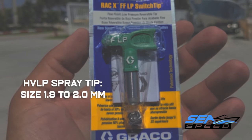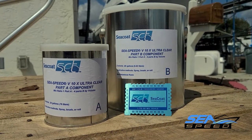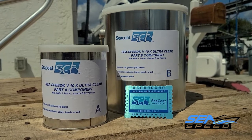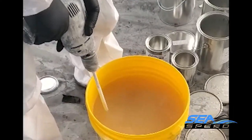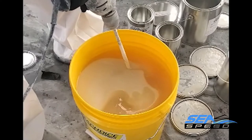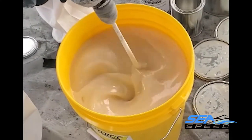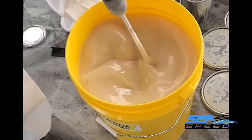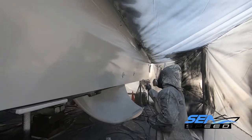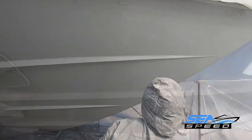Tip size for HVLP should be 1.8 to 2.0 mm. The mix ratio for C-Speed V10 Ultra Clear is one Part A to four Parts B by volume. Kits are all pre-measured for ease of use. Mix the Part B base components separately with a high speed rotary mixer for two to three minutes, keeping mixer blades submerged to prevent air entrainment. Lightly mix Part A by hand, then pour Part A into Part B while mixing for two to three minutes. Allow 7 to 8 minutes induction time prior to spraying or rolling. Do not thin C-Speed V10 Ultra Clear.